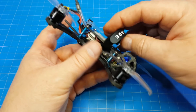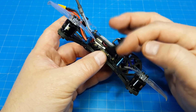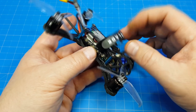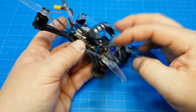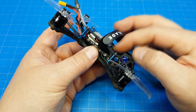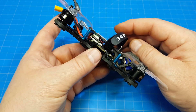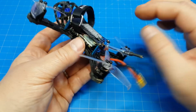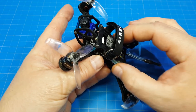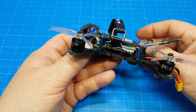Originally I had thought about putting the SHMDR — it's the DVR that's a little tiny thing — in here, but I decided not to do that because if I were to swap out cameras and get to the DVR, there just really wasn't a good way inside this particular stack of getting to the SD card and the button. So that's why you see the void in the front. Otherwise, I probably would have moved the receiver up in here somewhere, but it's right here on the edge. You also see I've got a little 5-volt regulator up there at front.